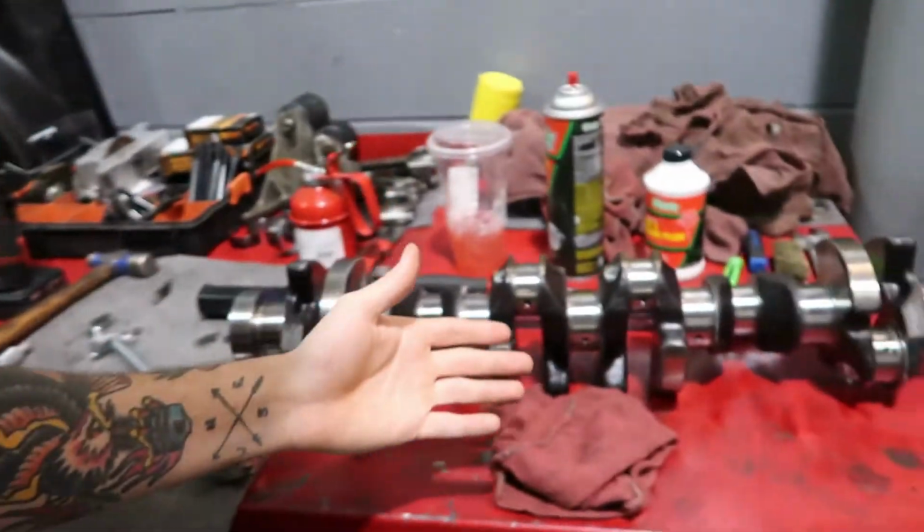That's all it is. And I'll put that sheet up, and I'll try to do a better recording of it if possible. But other than that, that's literally how you do it. And now if you were doing main bearings, take your dial indicator, measure the inside of the main journal on your engine, and then you measure your crankshaft, and then you figure out the bearing thickness, and same thing, the oil clearances are the same in this case.